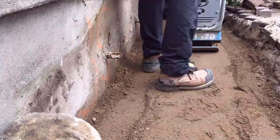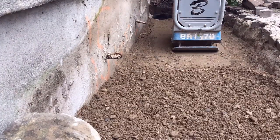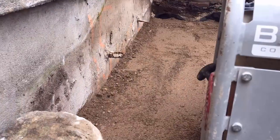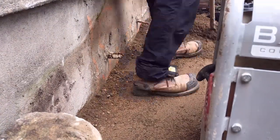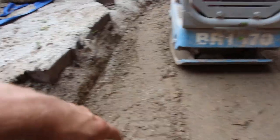We are using our BR 1570, which is good for about three and a half inches of material. That's why we compact this in lifts of three to four inches, no more. We want to make sure that our A gravel is nice and moist — we've got water added to it. Not too much, but not too little. It can't be dry.